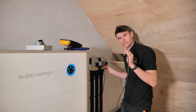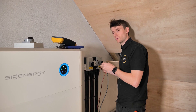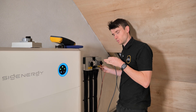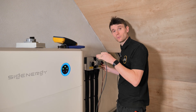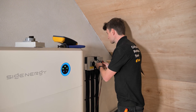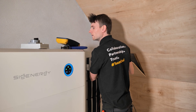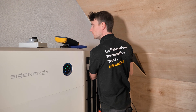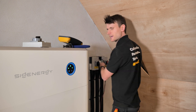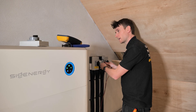The other half is dead. So with them swapping those plugs around, one half of the array is working and the other half isn't. Now we can add more solar tiles on the non-working side to start reducing the number of tiles we're unsure about. We're going to half the side that's not working and see what happens. Adding those ones in - we've added about an extra 50-60 volts, roughly 10 volts per tile. That's good - we know those ones are okay, so we're going to add some more.